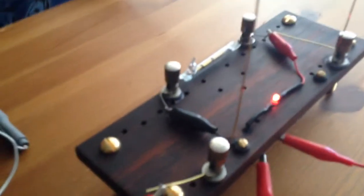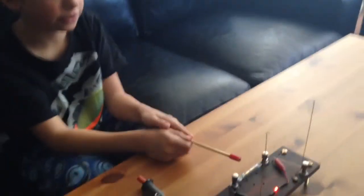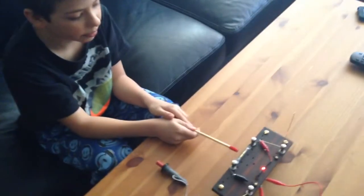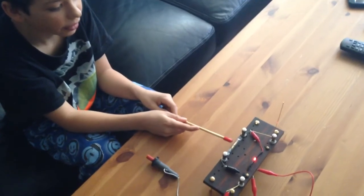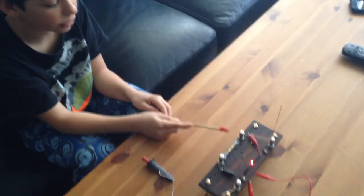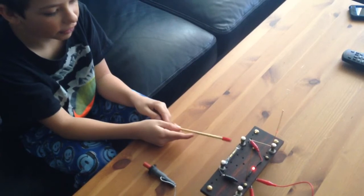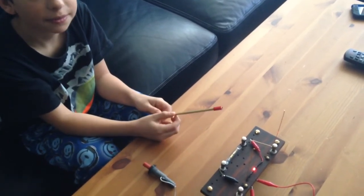So what is a radio detector? Explain to us. It's a vacuum in the glass tube. It has two brass electrodes and in the middle there's a metal powder that's 95% nickel and 5% silver. And then when it's off, it's 20 mega ohms. And then when you turn it on, the metal powder welds itself and it becomes its own wire. And then it becomes 20 ohms.